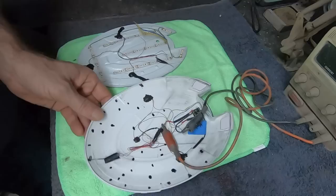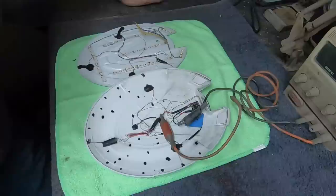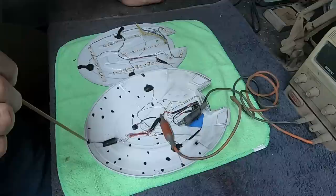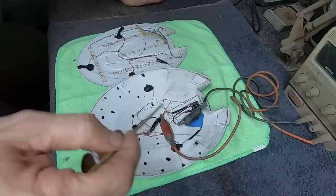Okay, we're back. I've been working on getting the control board mounted in the upper saucer. You can see where I put it — I picked out this little spot right in the back. There's no light groups or window groups around this little area and it's out of the way. The board is nice and small, especially on a smaller kit like this, and I just used some regular hot glue to glue it down in place. I've run off all my circuits — navigation connected to the three nav spots: the green, the red, and the white one up at the front of the bow, and a strobe light just behind the bridge connected to that circuit.